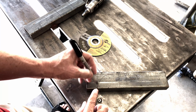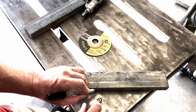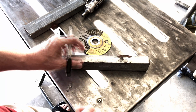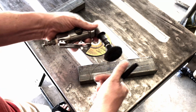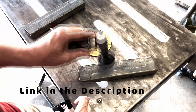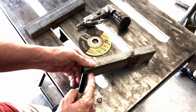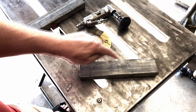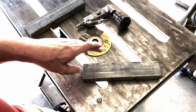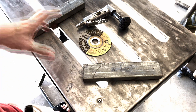I've got this section here and I'll bend it down, weld it, and I'm going to try with flux core and then try to do the same thing with TIG weld — cut it off and weld that seam, so I have a nice round radius on the edge of what's going to end up being a stand for a floor lamp. I'm going to take my air angle grinder with a Benchmark Abrasives surface conditioning disc and take all the galvanize off the outside of this tube so that when I TIG weld it, hopefully I can do it successfully. I'm going to use a small fan in an open area to blow smoke fumes away without blowing my welding gas away.